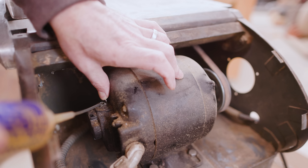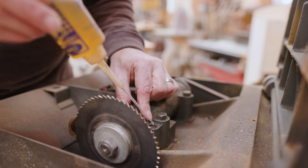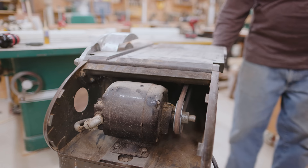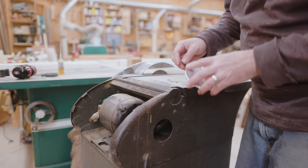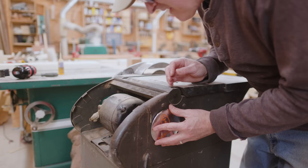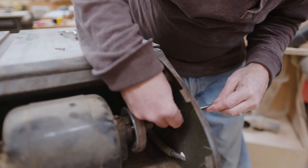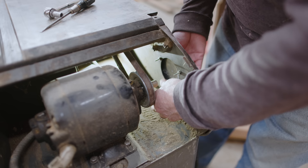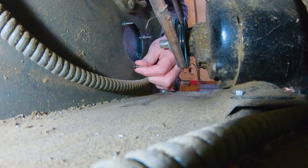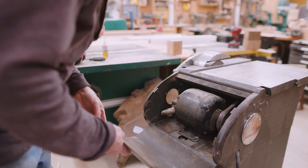While I had access to the motor, I added some oil to the oil cups, and I decided to do that to the arbor for the blade as well. It seems to run nicely. In the cabinet of the saw, there are three holes that match up perfectly with the holes on this nameplate, so I'm really guessing this is where it goes. There's a hole on the other side too, and I'm thinking maybe I'll make a little vent plate to go over that, to allow at least a tiny amount of air circulation around the motor. The screws didn't thread into the cabinet, so I actually have to have nuts on the back side — so they're more like little miniature bolts. Then the back went back on.